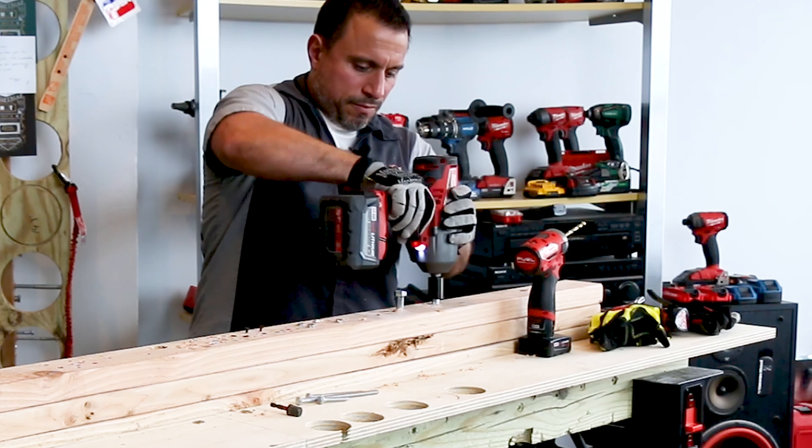Another time you don't need to pre-drill is when joining pieces of wood with wood screws. Even a three-inch number 10 screw like this one can be driven pretty much effortlessly with no splitting. However, if you were driving gold screws, deck screws, or something similar that wasn't self-drilling, you'd likely need to pre-drill to be effective and efficient. These newer self-drilling style fasteners remove a lot of the need to pre-drill before setting your screw.